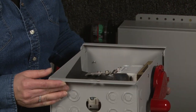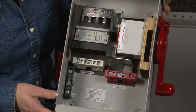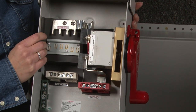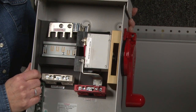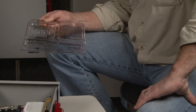It comes with a half-inch conduit knockout at the bottom — several of them — and a din rail space for up to four fuse holders. It also has mounting for the optional birdhouse power supply. It comes with color-coded snap-on bus bar covers, 80 amp bus bars, and a 115 amp switch.